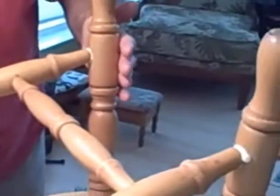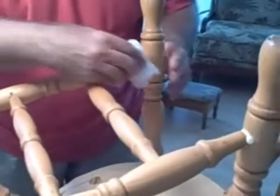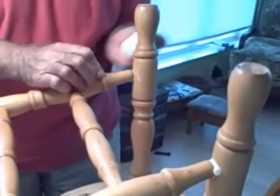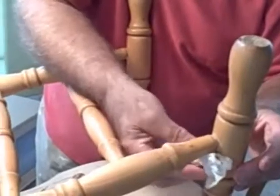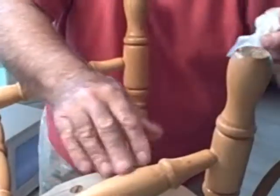I'm going to get the glue off my fingers, then bang the spindles down into the holes — bang that one in, and forward, forward. See how they've seated themselves? They've gone all the way in. Now we're going to have excess glue, which we have to take off. There's excess glue over here — we need to take that off. Okay, our extra glue is gone.